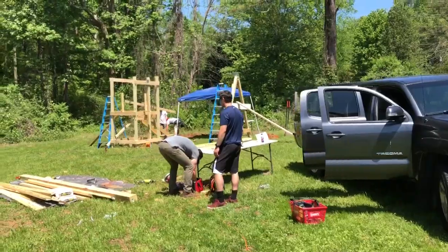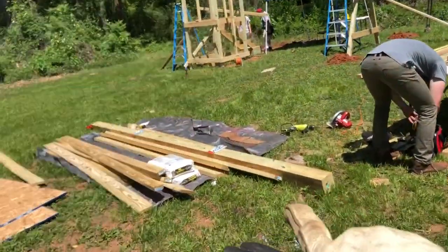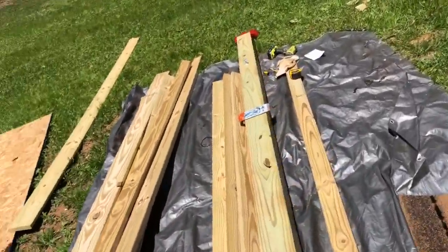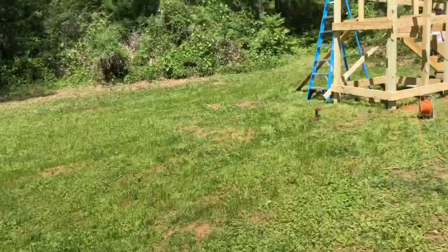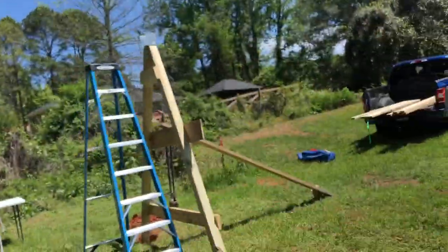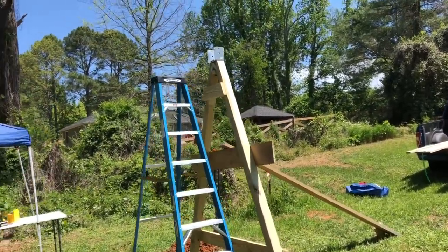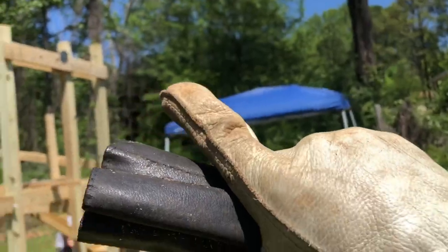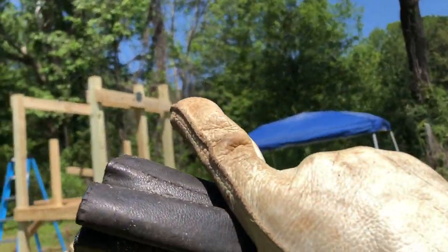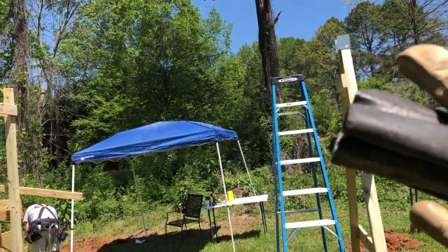All right, so we've now got the box in, and we're setting up the beam with the swingset clips. We've got the A-frame stationed. We tried to get it level as best we could while we're getting ready to measure off the beam. It's a 16-foot beam, 6x6, so it's going to be 14-foot clear. There's going to be 3 swings in here, so that's a long span, and there'll be a little bit hanging off the end.